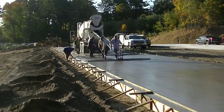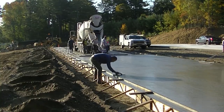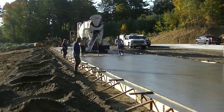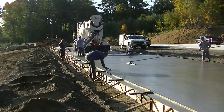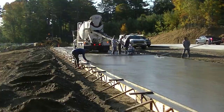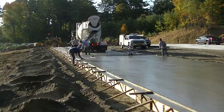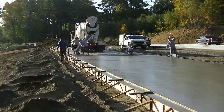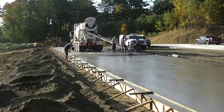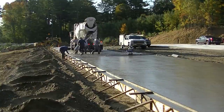There's no slope to these slabs. When they build a storage shed slab like this, they're all level — everything's perfectly level, at least as level as you can possibly get it. You can see Jim keeps going back magging those edges, making sure the edges are all nice. That makes a big difference when you go back to finish these things — if you can get your edges as perfect as possible when you pour, the finishing process is so much easier, especially when you're out in the sun with temperatures in the 70s or 80s.